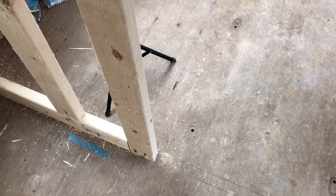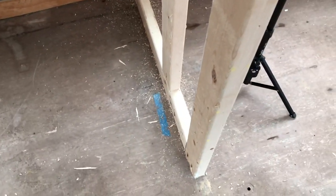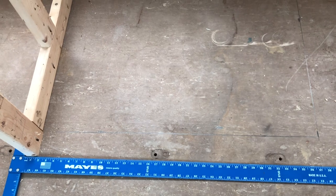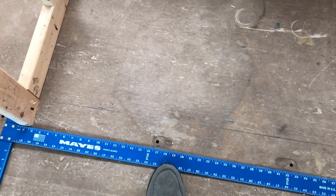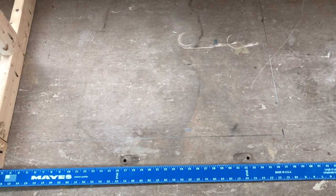One other thing that the 36 does for me — these doors are two-foot doors. Even though I had to move this door over to the left, my overall bathroom width is five feet. If I go three feet into here with a shower pan, that leaves me two feet for the door. So even if the door opens up, it would open up into this space here. I could still have a flat door walking in, and then this door would open up back this way and be up against the shower. If I have to go 36 by 36, I may have to work with the door a little to allow enough room for it to lay flat up against the shower.